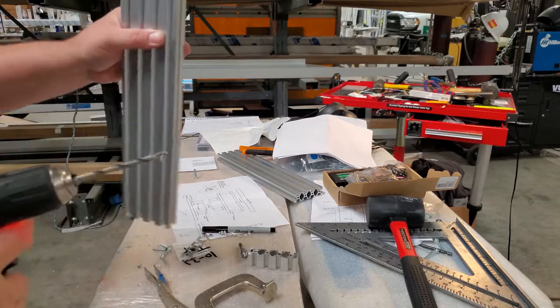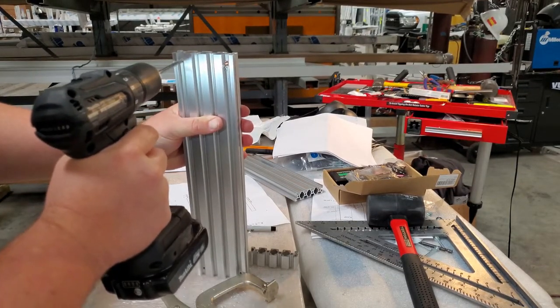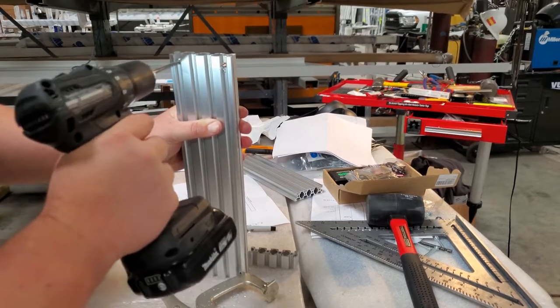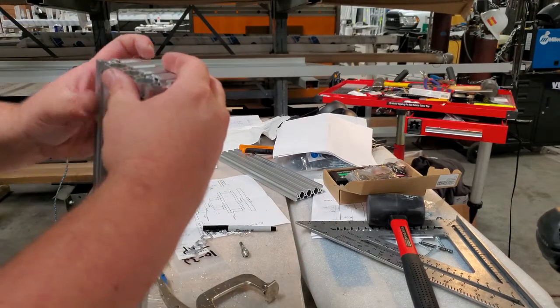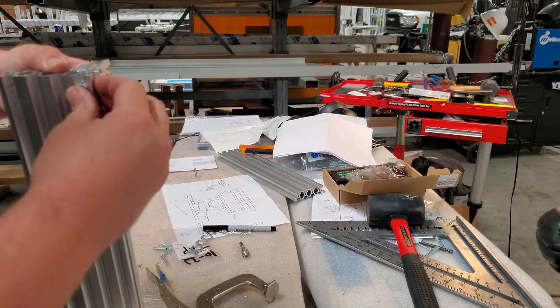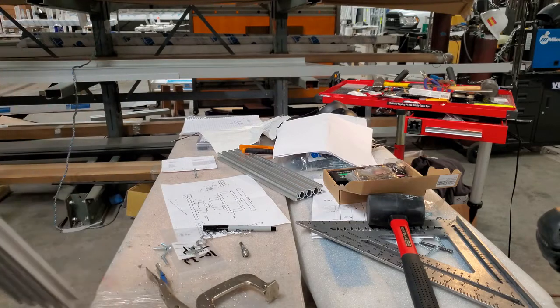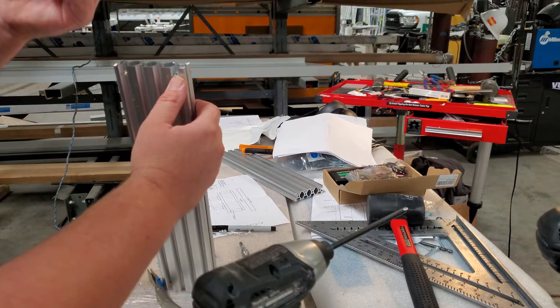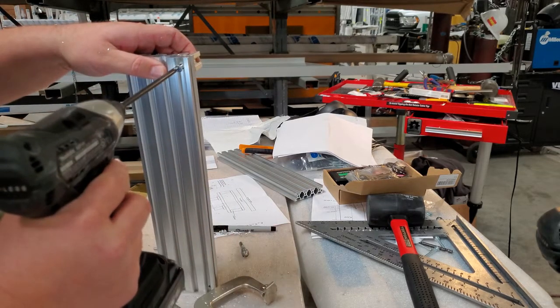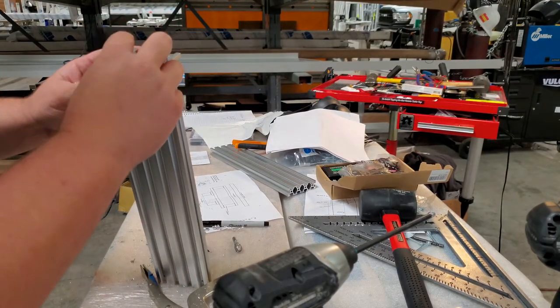I can't even get that to drill — let me try a slightly different approach. Okay, let's try that again. Now I have a place where I can thread my screws, these being 10-32. Go ahead and push them through. These are short screws — I've got to get some longer ones. I don't like to start machine screws with a drill, but I'm going to do it because I don't see my screwdriver. It should be on slow speed. Go ahead and start that one real slow, start this one real slow.